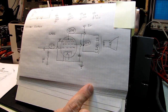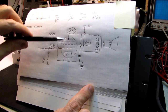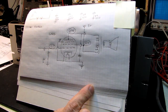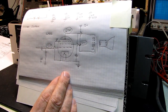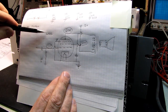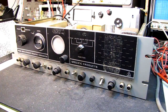I can't make sense of the screen voltage being so much higher than spec, but one fact is certain: the screen grid inside that tube is glowing quite red — and it's not the filament. There's also a red blush circle on the anode. Until I can track that down I can't make much more headway. I think I'm going to get a 6AK6 — maybe the owner has one, as he has quite a collection of radio paraphernalia. I'll drop him an email. We'll show you briefly how it sounds and then shut it down because we don't want to do any more damage.